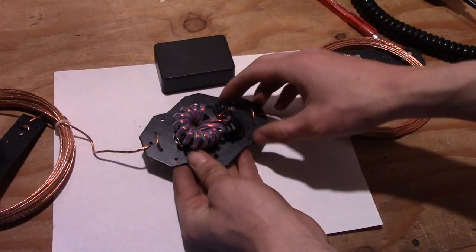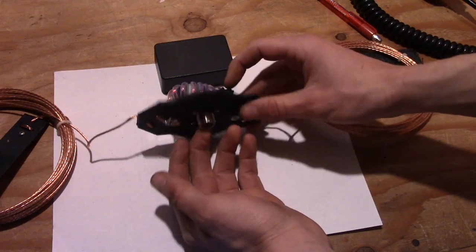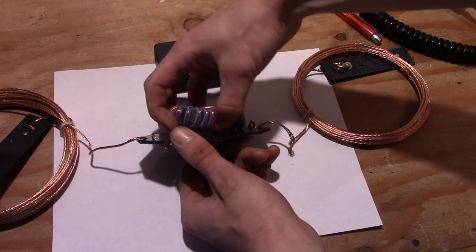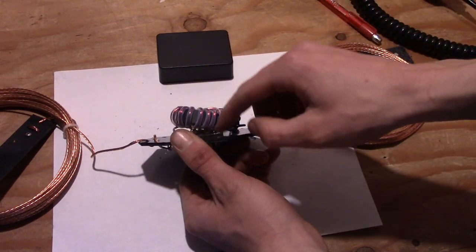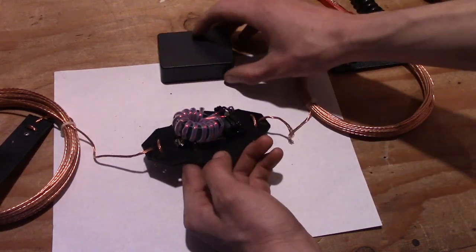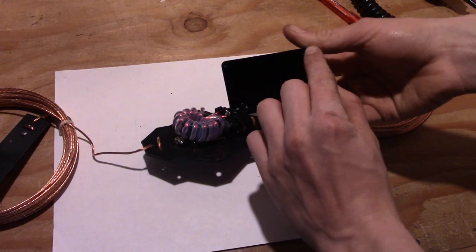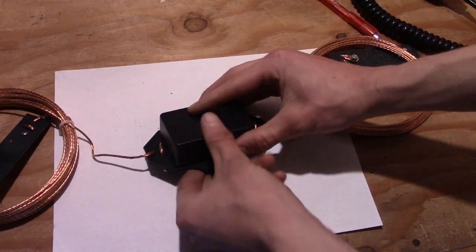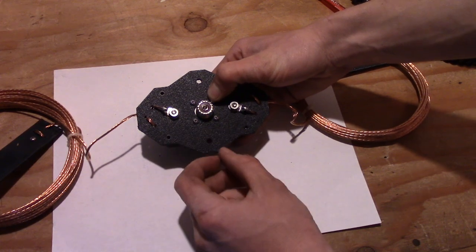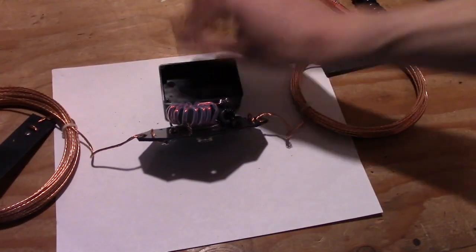So what I'm going to do is put this in the air as-is and test the SWR with the SO-239 connector. If it doesn't work, I will disassemble this and solder my coax directly to where the two SO-239 points are soldered. One more critical note: this box is just slapped together plastic, so you're going to want to put a large amount of silicone on the edges, and also a ring of silicone around the SO-239 connector. The material is weatherproof, but it is not water-sealed, so you definitely want to do that before installing it.